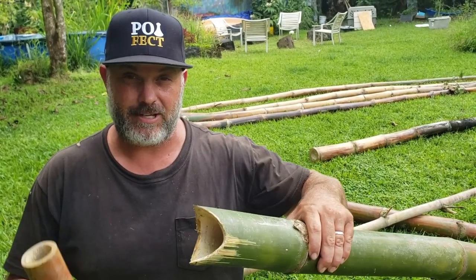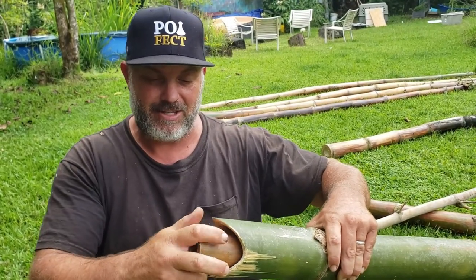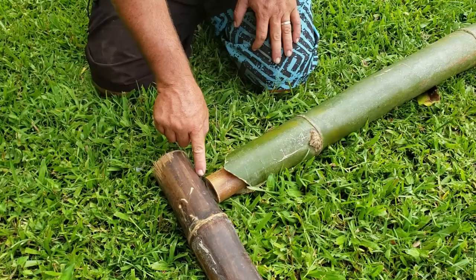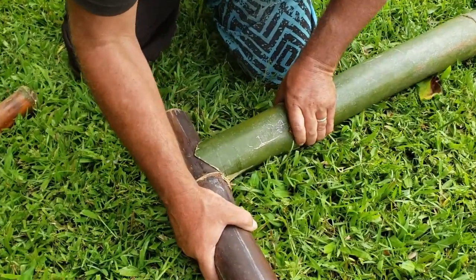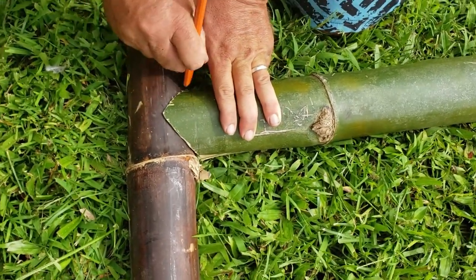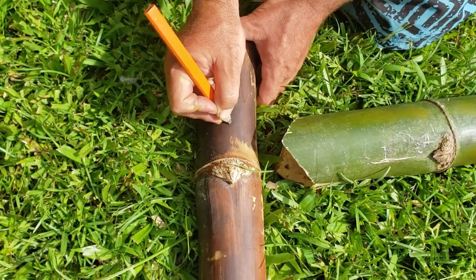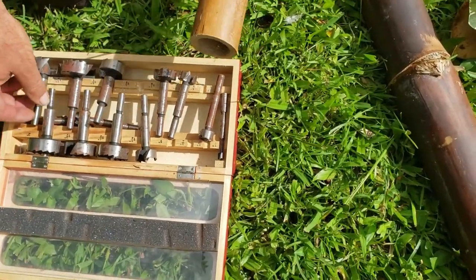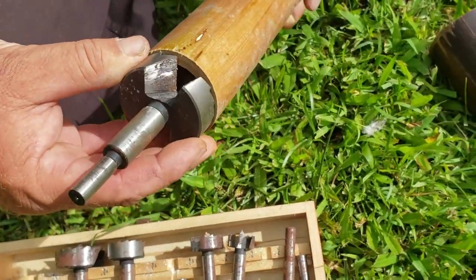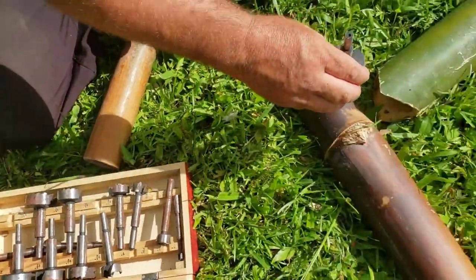To make a modified fish mouth joint, we're going to take the fish mouth that we already created and we're going to take a bamboo insert that's a little bit smaller. We're going to be able to slide it right into this piece here, and then this piece will fit into this piece here. But first we have to measure out our hole and then drill a hole. Put the bamboo where you're going to want it, make a little marking, see where our bamboo is going to be, and then put a little center point. Then we're going to find a drill bit — it could be a hole saw or one of these Forstner bits that would fit this bamboo. So when I drill the hole, I can carve it out just a little bit.